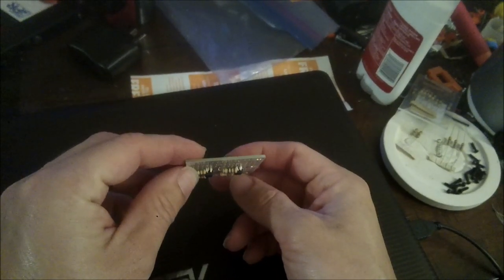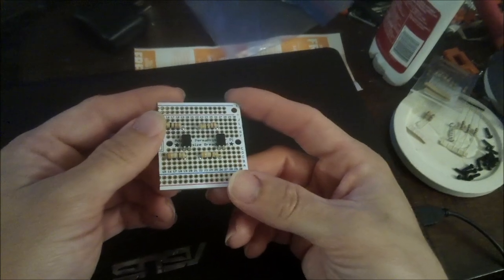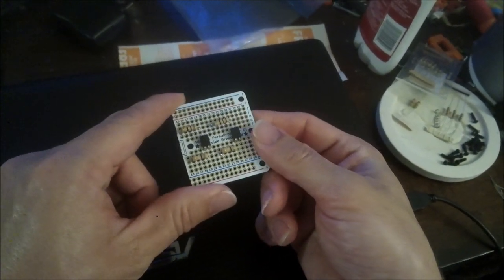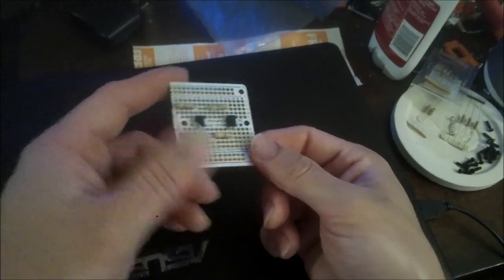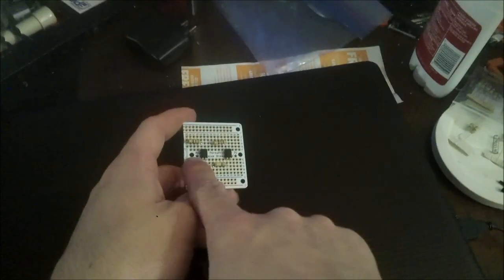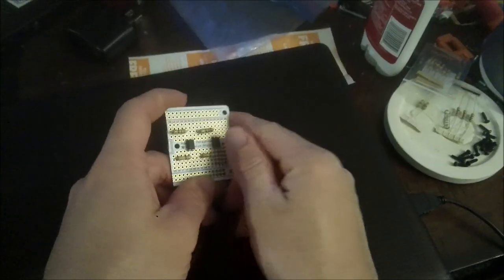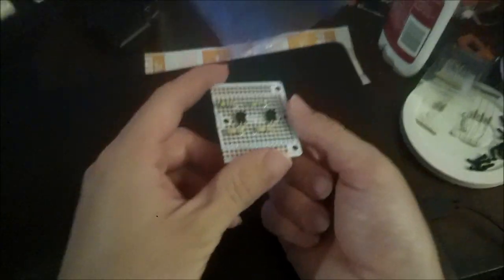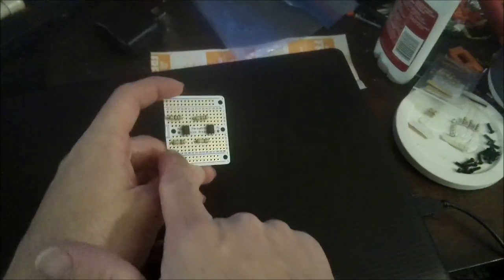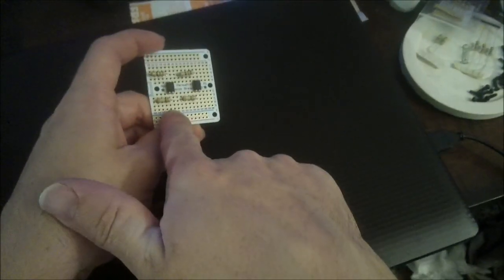We have to keep the board functional while at the same time trying to run massive loads of power to the motors. So to that end, we're going to add a little board of our own here with the breadboard shoved into one of the empty spaces on the inside of the shell, and we'll just use that to signal things open. At the bottom here we have a 190 ohm resistor, and then through the infrared diode end of an opto-isolator. I have a small little case of PC817s that I occasionally use for experimental things when I want to isolate circuits. So we'll have one of the motor leads go here, go through the whole mess here, and come out here, and then back to the board.